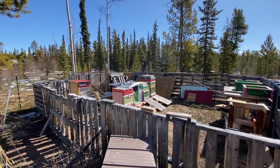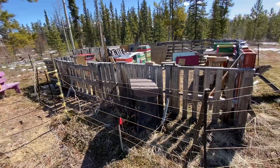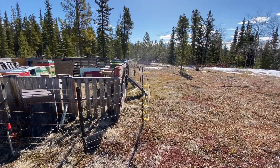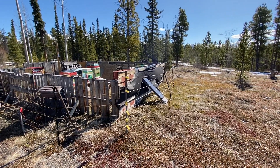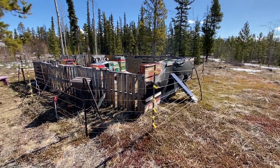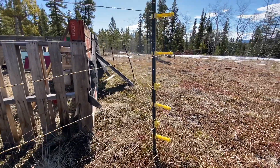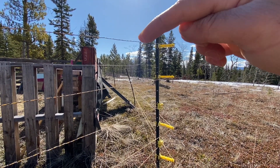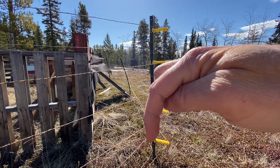What I'm going to show you now is my electric fence setup. You'll notice lots of wires. We've got grizzlies and black bears up here, so the goal is basically maximizing the zap that the bear gets from the shock. The way I set it up is so the top wire is hot, ground, hot, ground, hot, ground.